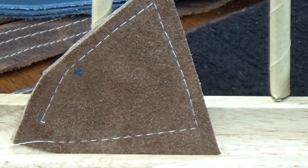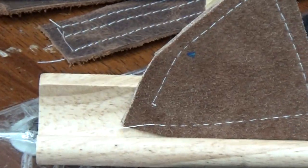I think you're going to notice, unlike the protected full grain leather, where Barb made the astute observation that it was being pulled up too hard, is what she said. And that's because that upper tension was muscling it too hard. I backed it off just about a millimeter, and look at the fullness of the stitch come back. Again, we're looking at two different leathers now. We're looking at a single layer of elk hide versus two layers of protected full grain leather, or three layers of, two layers of saddle grade leather, three layers of protected full grain leather. But nonetheless, elk hide is elk hide, folks.